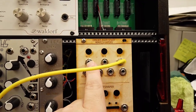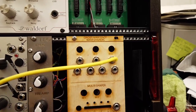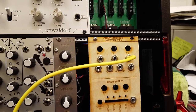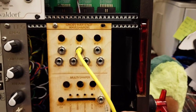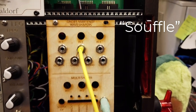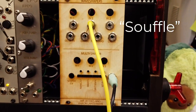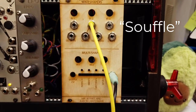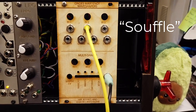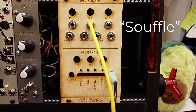If you were to change the volume of the waveform going into the wave shaper, you'll get different effects. We also have another output down here which is the noise output. There's a trim pot to adjust this — I just adjusted it until I thought it sounded the best. You might make that a front panel control.